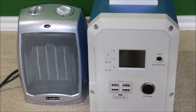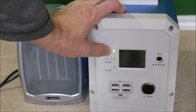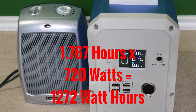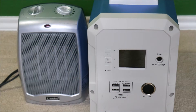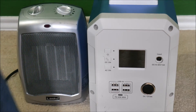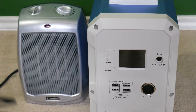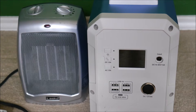After one hour and 46 minutes the unit shut off, averaging 720 watts for that duration, which equals a grand total of 1272 watt-hours — obviously less than the rated 1500 watt-hours. I knew that would happen because of Peukert's law: under high load a battery will not produce as much power as it will under a small load. Lithium batteries do still behave according to Peukert's law, although they exhibit the effect less than a lead-acid battery does.